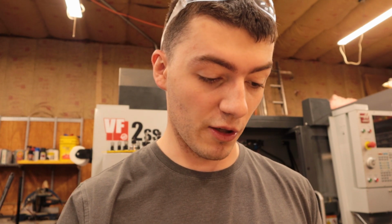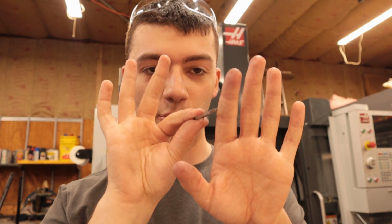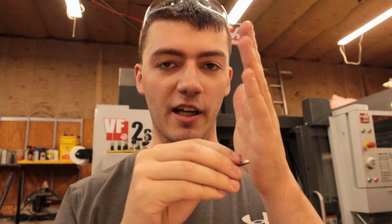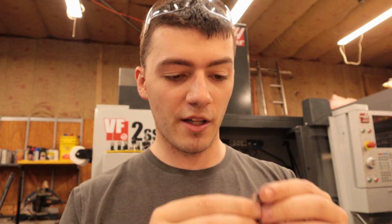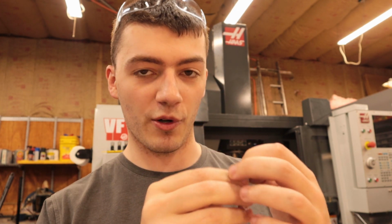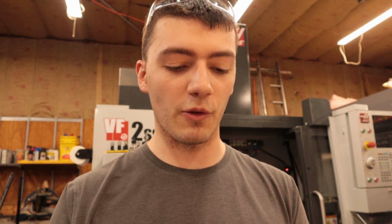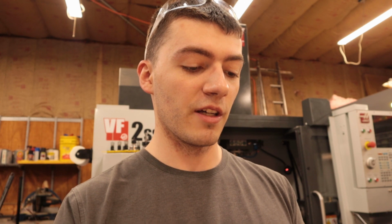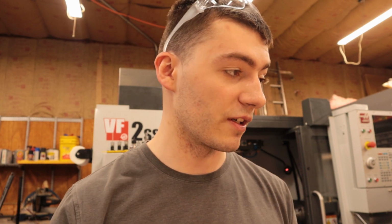So what I've been having to do is, on the belt sander, I just push these on a flat surface up against the belt, and that kind of decks the front, if you will. You can't see it on camera, but there's a very small flat portion on the tips. And then what I've been doing is rubbing overlap sandpaper equally on both sides of the jaws to get that arc out and get them back to parallel. That is a huge pain, by the way, and it takes a couple minutes per tweezer.